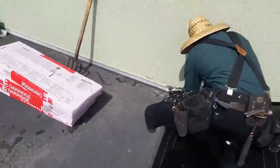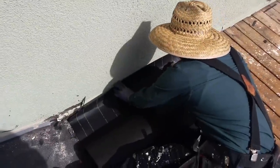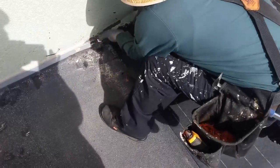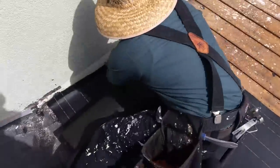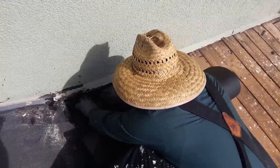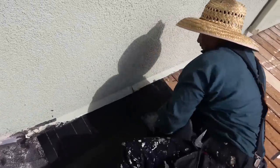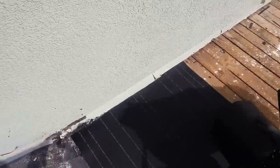He's going to fold it and tuck it underneath the flashing. Make sure that you tuck your paper underneath the flashing — underneath the z-bar. The paper is supposed to fold at least one inch onto the wall so that way you prevent any weather penetration. Eventually water might get in but it will take much longer. You can't just cut the paper right there. See how the metal is folded all the way up — that's the way you do it.